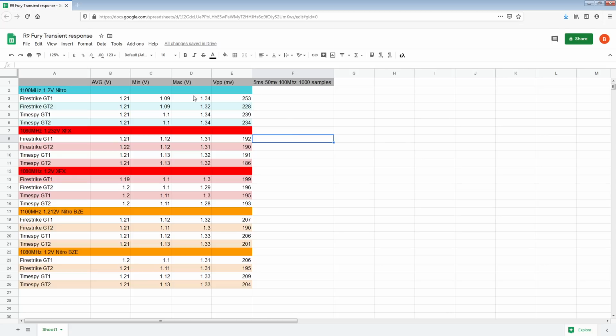Like, because the thing is, if you look at the max voltage, it looks like pretty major differences. But the overshoot is potentially concerning for the longevity of the silicon, but not really. Whereas the minimums, this is what actually affects your overclocking. Most of the time the minimums, there's one motherboard I tested where the minimums on it are absolutely horrific. And it's so bad that it's actually noticeable, a major disadvantage in terms of overclocking capabilities.